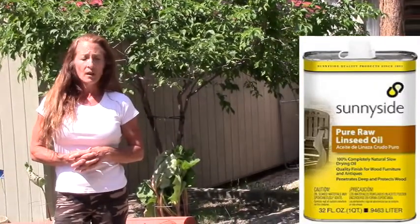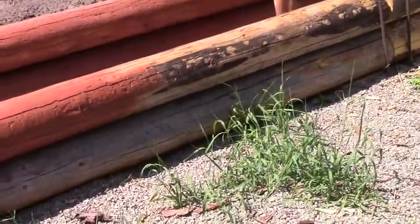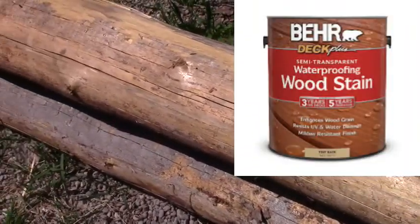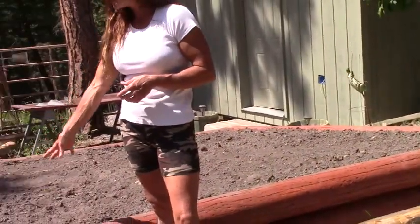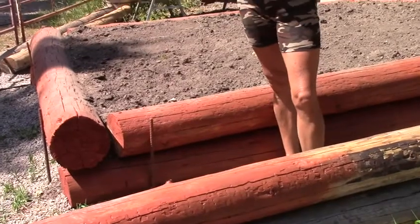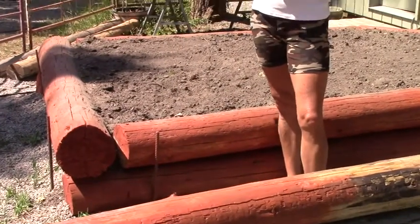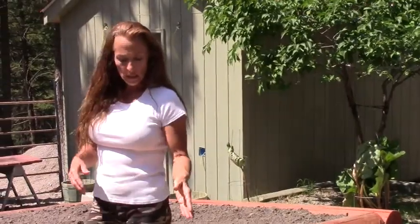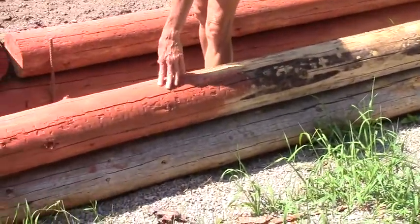If you're trying to be an organic farmer you'd probably use linseed oil or some other heavy-duty organic oil to coat the logs. I've used that on lots of projects, but it does not last as long as a waterproof stain. This stain just happened to be colored because it was left over from my porch, but these logs on this side have a heavy-duty waterproofing stain. I really would not recommend doing these logs without some kind of waterproofing, because they will rot — especially with all the water you'll be using to water your garden.